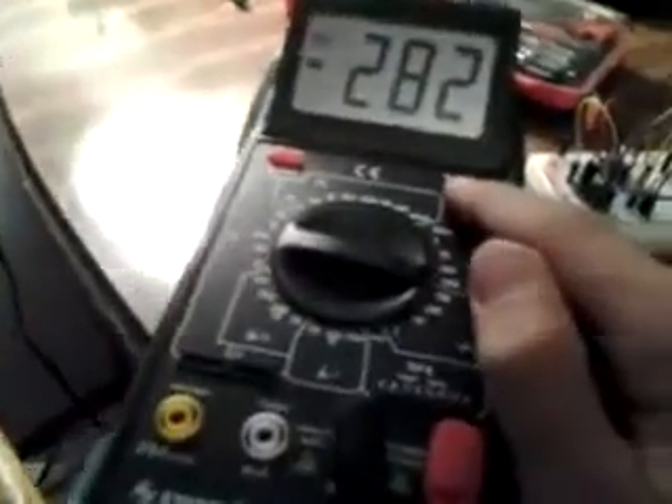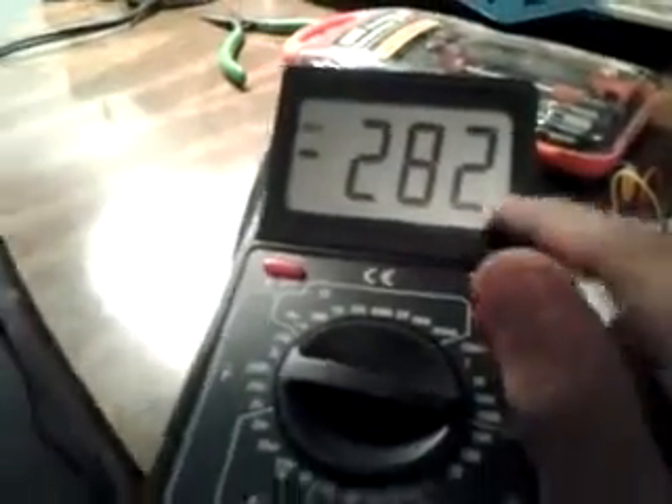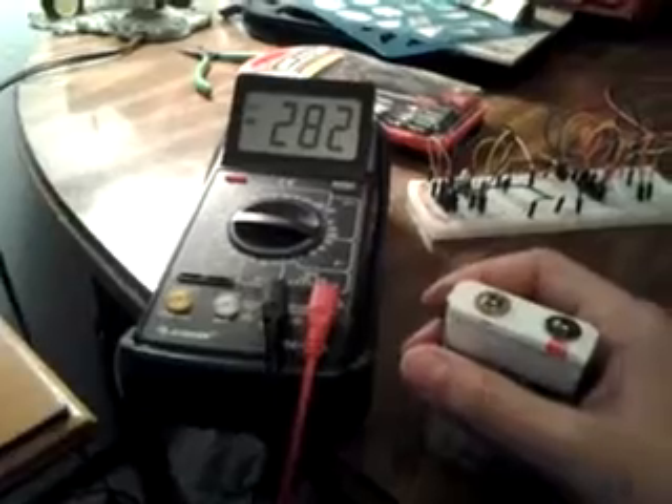You might be wondering how many volts this puts out. There's a hold function on my multimeter, and it actually dropped — it was at 288 before, but 282 volts is what it sank to. It's hard to do it with one hand, so I can't show you, but it is 282 volts. Really simple project. I got the idea from another YouTube user — I'll have a link to his video in the description. This board required no additional work to make it function; he had to cut up a Kodak board. So my project was a little bit faster than his.